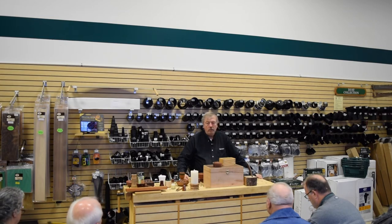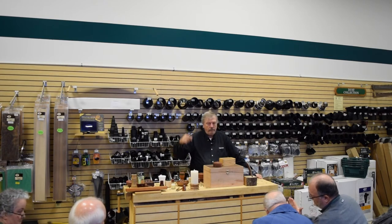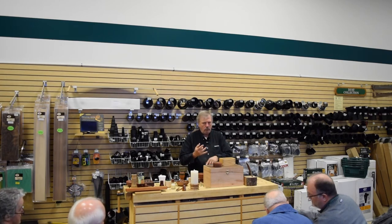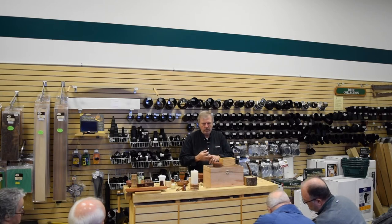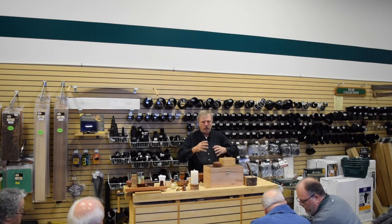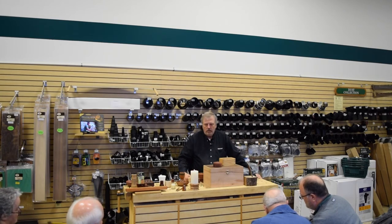If you go out and look around, you'll see other examples of 3D cutting boards. The other one is basically you're going to make diamonds. When the diamonds are made, you've got a walnut diamond, a maple diamond, and a cherry diamond. Then you start gluing them together so that there's three together, and you'll have this little shape. Then you start gluing those shapes together. When everything's all done and clamped, you cut everything straight to the right size that you want, and you've got a 3D cutting board.